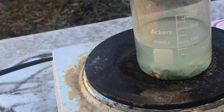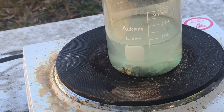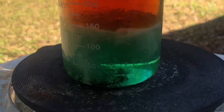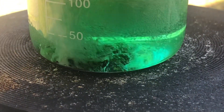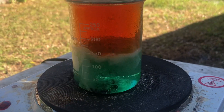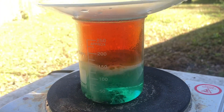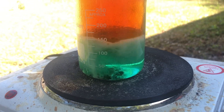It's already starting to attack and eat it. I'll be back in a little bit. Pretty vigorous reaction — it's eating away the silver and the other base metals. I'm going to be left with a gold powder at the bottom. I'm going to filter that off, and then put that powder into aqua regia.